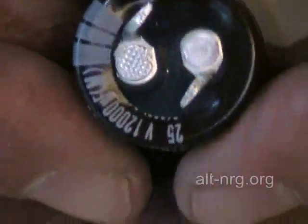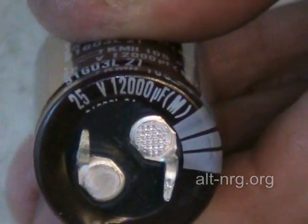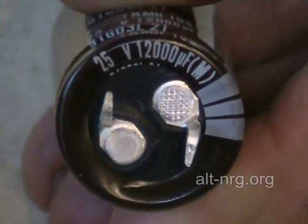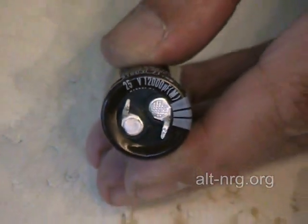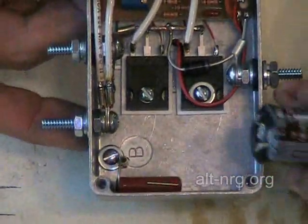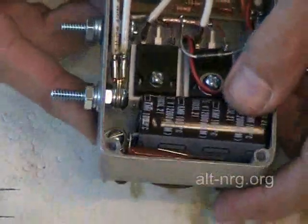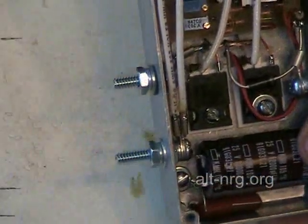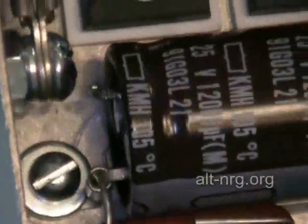The way this is going to sit inside the case, the negative terminal is to your right and it faces down, and that tip is going to sit in the end of the ground lug at the corner of the heat sink, along with C5. I'm just going to take this now and line it up and set it in there.